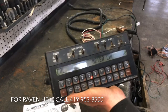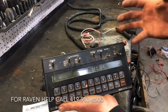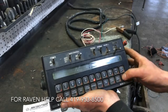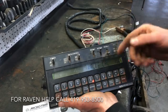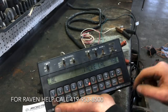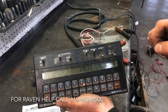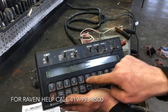We go over to meter cal. This is the pulses of your flow meter that equal one gallon. Each one is going to be different. You need to walk back to your flow meter — there's a tag on it that's going to give you this number. I'm just going to punch in a dummy number here — 750. Hit enter. That's likely not going to be correct, but read it off your own flow meter. We skipped valve cal — move on to valve cal. There's a sticker on your valve; read this off of your toolbar. Let's say it is 750. Hit enter.